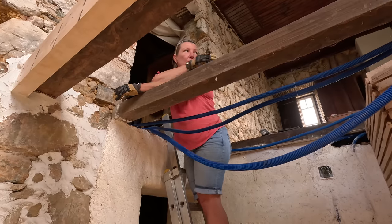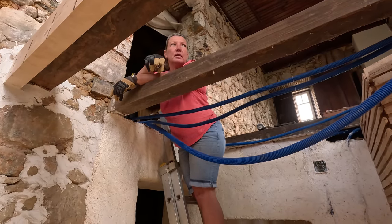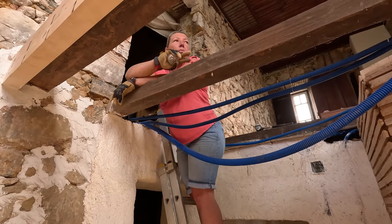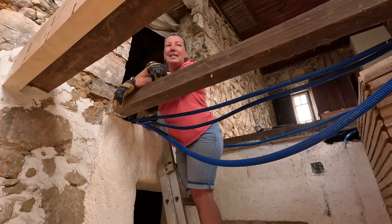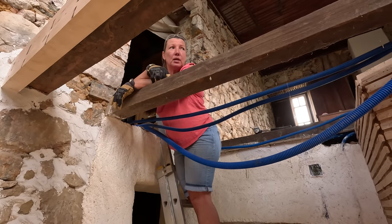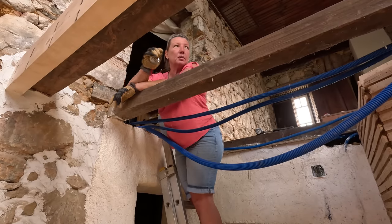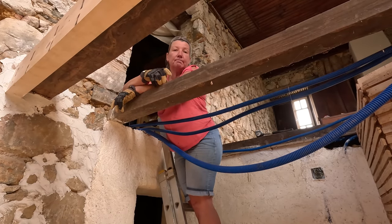And then we have three joists that are going in this gap. The other reason we want the insurance here is this is going to be the landing for the staircase, so really want it to be pretty solid. We'll also put in a load of noggins across this way, again, just to give added structure. But these are 80-year-old chestnut beams. They are super hard. They're so hard you can't pull the old nails out of them, which is why we angle grind them out. So I have no hesitation believing these two beams are absolutely fine. But since we're here, we're just going to add some insurance.